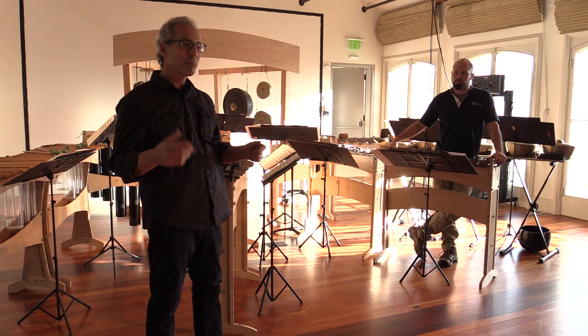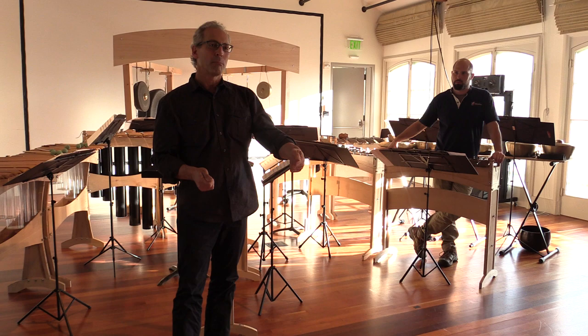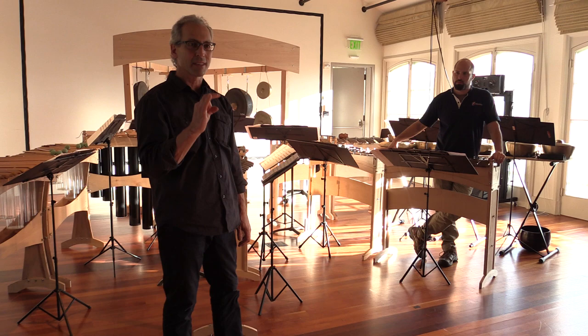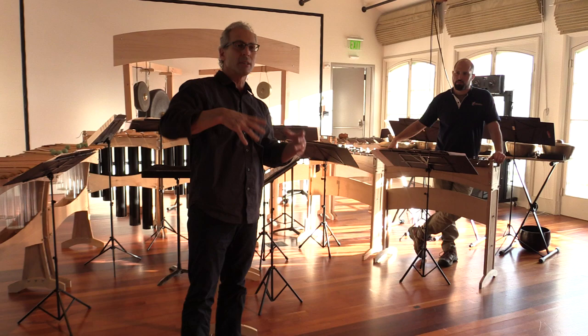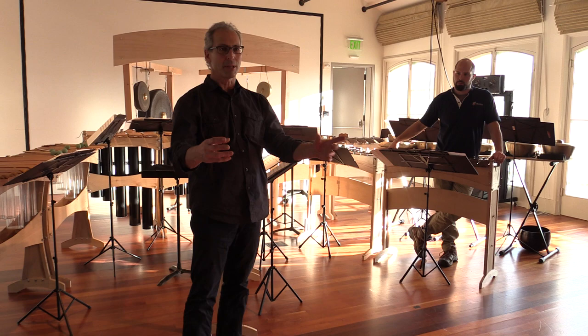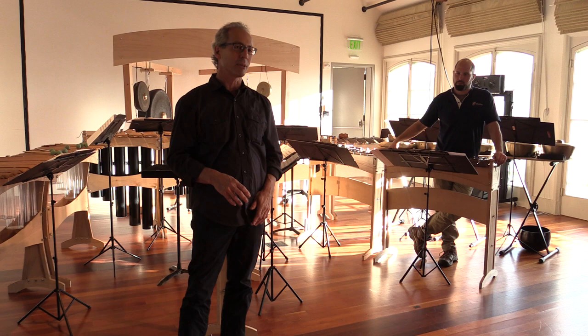But part of the reason they do it so fast is that you only get about half a revolution before it's too cold again, they have to put it back in the fire. So they want maximum numbers of strokes. But every stroke has to hit an area about like 3/4 of an inch. It has to be within that accuracy in order to do it properly. And so they start in the middle and they spiral outward, going back in and out of the fire. And eventually they start forming the feet, the shoulders, whatever you call it, of the shape. And then getting the boss, the knob, is kind of later on in the process. And it's really amazing.